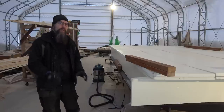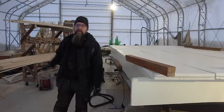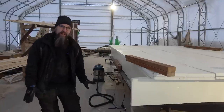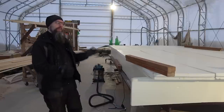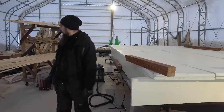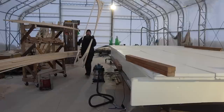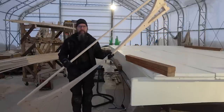But today I'm gonna prepare everything for the second half of the frame number 6, milling some slats to thickness and all that kind of stuff. But then I also realized that if I'm gonna be able to laminate the frame number 7 in a few days, I really need to laminate today the floor piece stock for that. So by that I mean this stuff, solid timber stock, where I'm gonna CNC cut the floor piece out of.